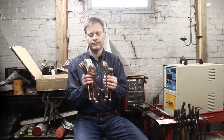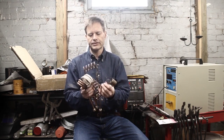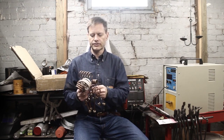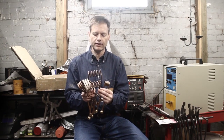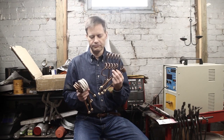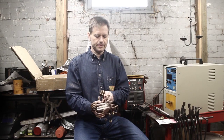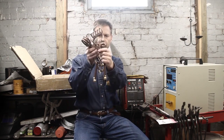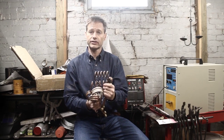For rectangular stock — more square stock or round stock that fits in these coils — the tighter the fit the better. This is a decent compromise coil with quite a bit of spacing. Sometimes if you put three-quarter stock in, these were bent around half inch inner diameter US black pipe. Makes for a pretty good size — it's about the smallest I ever used. These slightly larger ones were bent around three-quarter inch inner diameter.